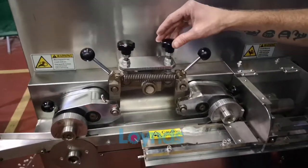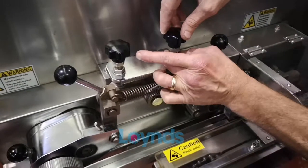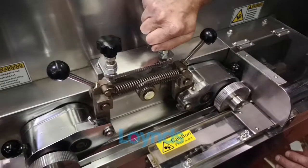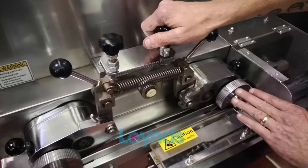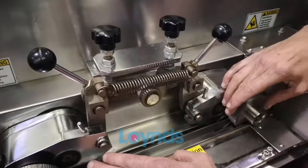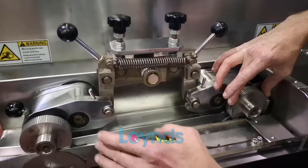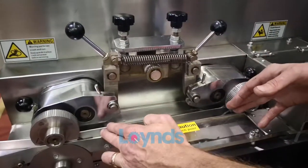If the product size is too large and you want to reduce it, break the backing nut and turn it counterclockwise to push the roller down, or the opposite to lift the side of the piece up. This controls thickness in relation to the piece. If you get bunching between the two pieces, lift one up slightly and lower the other to balance it so it drives the rope nicely.